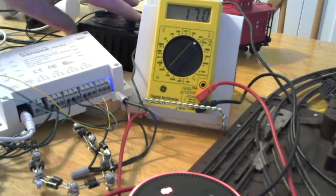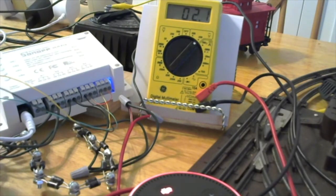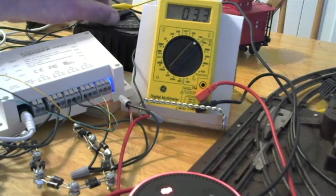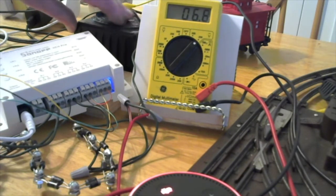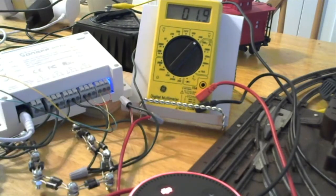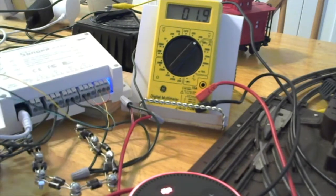And if you vary the input voltage on the transformer, obviously you can get that down. So when all the diodes are in play, you can get as low as whatever you want out of the transformer, even as low as 1 volt. If you're running HO or something that needs only DC power, you can put a rectifier and capacitor on this, and you could also feed DC through this. This diode technique will pass AC or DC. It's not DC polarity specific.